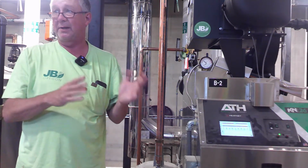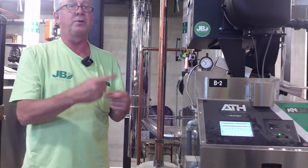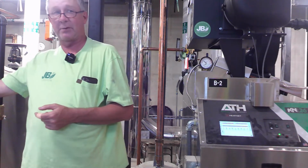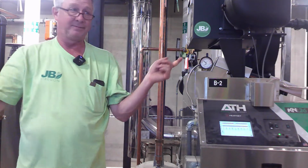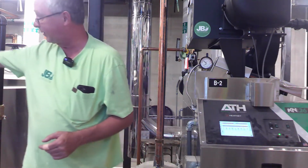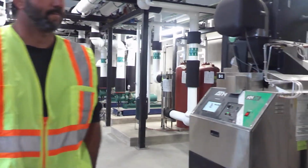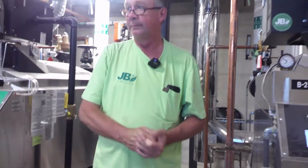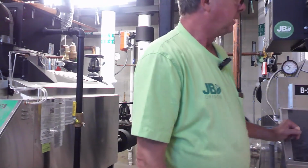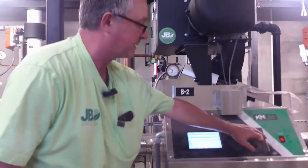If the boilers had their own individual boiler pump, I could care less, because that boiler pump creates its own flow through the boiler loop. Those have to create the loop or the flow for the whole system. So if you see a local flow fault, you might want to walk over there and make sure at least one of those three pumps are on. If they're not, turn them on. Why would they be off? I don't know. That'd be a good question for the control contractor. So that's it. And the only way you can reset that local flow fault is to cycle power.